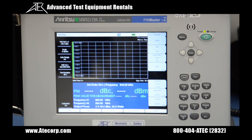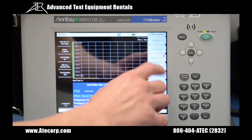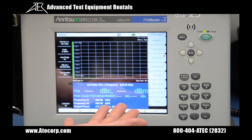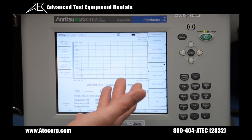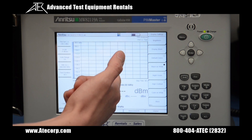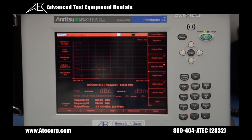I'm going to show you how to change your display depending on your environmental conditions. Go to Shift > System, bring up system settings, then System Options > Options > Display. You can change your display from the default black-and-blue screen to black on white — suitable if you're out on a bright, sunny day and want to view your screen more easily. There is also a night vision mode, which is extremely handy when making tests out in the field at nighttime.